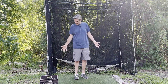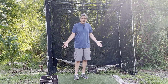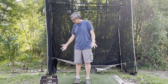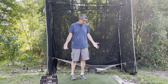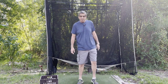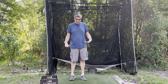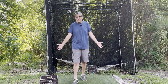This wood — when I put it down, I didn't know how permanent it was going to be, so I didn't go through the expense of buying pressure treated wood. I just bought some basic two by sixes. They're getting old now, they're starting to weaken. I've got some areas in this pad that I can feel are kind of starting to sag a little bit. So it's time for me to go ahead and dismantle this and pour a permanent concrete slab.